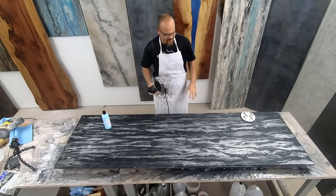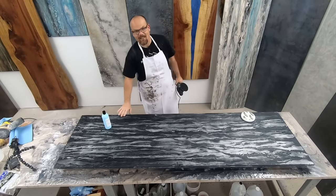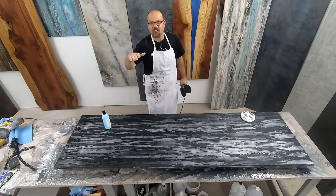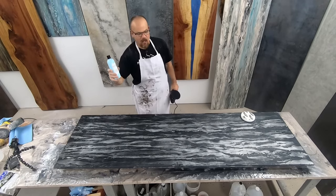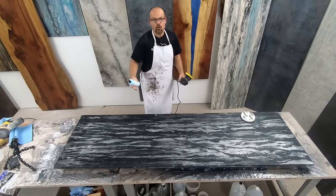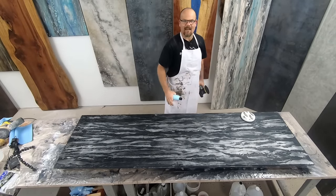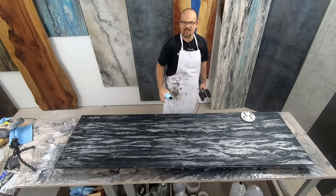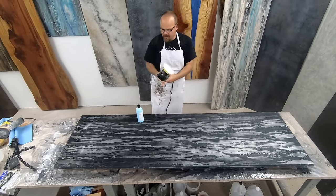Okay guys, we're all sanded up and it feels really, really good. This would be a great place to stop if you wanted a matte finish — just use a cleaner and clean it off and you'd have a great matte finish — or you could stop at whatever step you'd like depending on what sheen level you want to achieve. At this point we're going to use our polishing compound and polish this out. We start in two-foot sections and work right down the piece. I'm going to use a white compounding pad on a dual action polisher — you want dual action so it's rotating as well as vibrating and you get a really good finish. A five-inch pad works really well, and we're finding better results with a dual action than a regular orbital.